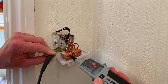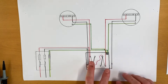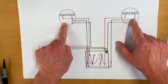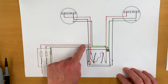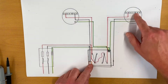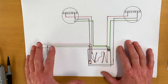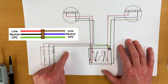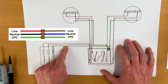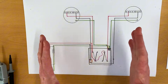I've put together a wiring diagram similar to what we had in the installation. Here I'm replicating the two-gang switch - it was a dimmer but it's a two-gang switch. We had a set of lights and the set of lights independently switched from there, with the feed coming into the actual switch, then switch line, neutral and CPC out. I've used old cable colors because the video also had old cable colors - line is red, neutral is black, and green and yellow is our CPC.